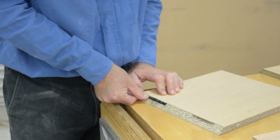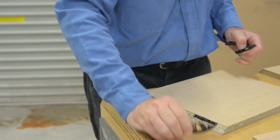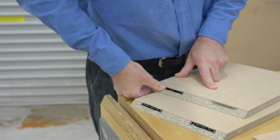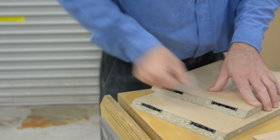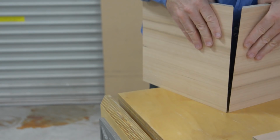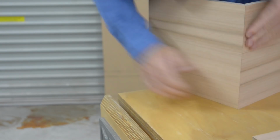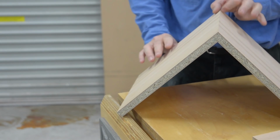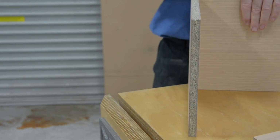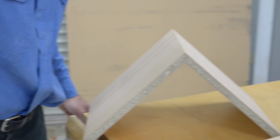So now I'll put the fittings in and see how they slide in. So that's what we put in this first side. Here's the counterpart. So let's see how they go together. The beauty of this setup, we refer to the outside edge, and the outside edge is very, very flush. We've got a little bit of latitude to be able to adjust these things slightly, like there's a couple of millimeters. That's now quite perfectly flush, both sides. See all that. Just lift you and move you around, there we go.